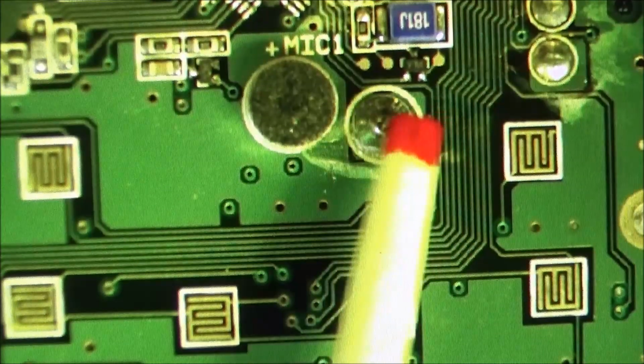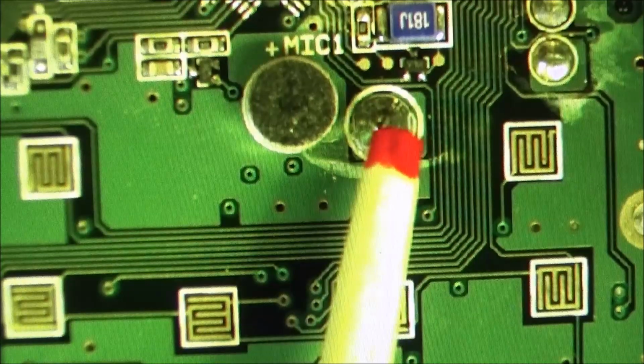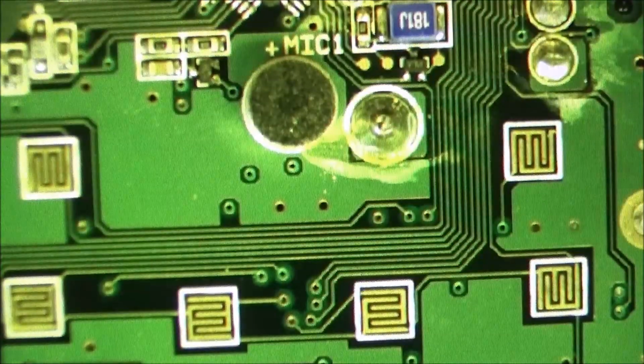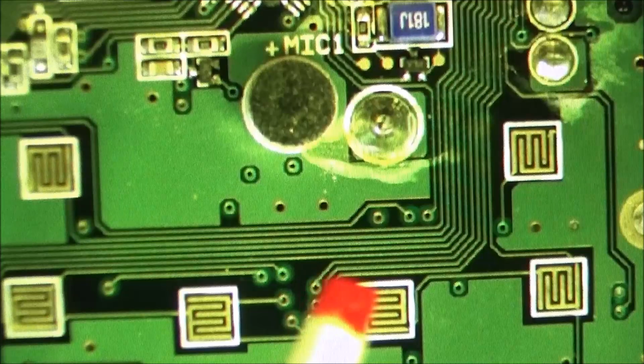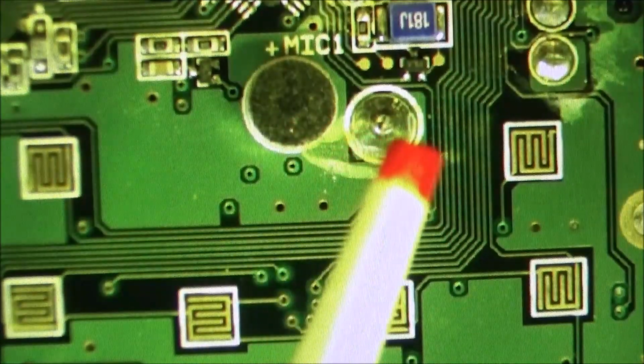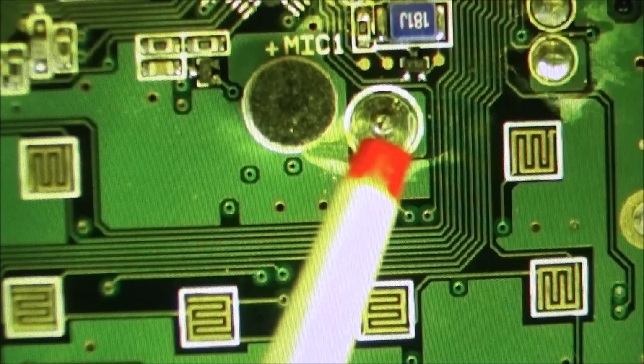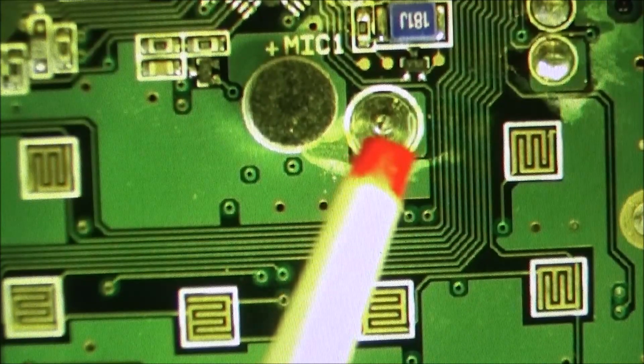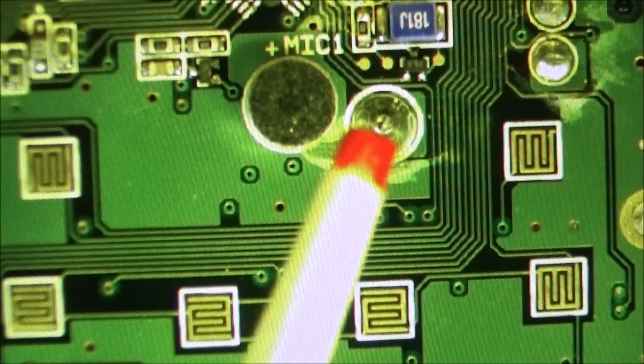The soldering doesn't look that good, and it looks like there's a crack right around the top of it. And you know, you can take a circuit and it'll show voltage. In this case it should show 9 volts, and it'll show 9 volts, but a crack in anything that's got corrosion in it can drop the amperage. And that's probably why when it keys the microphone or hits the PTT, it shuts down. So it's probably not making good contact.